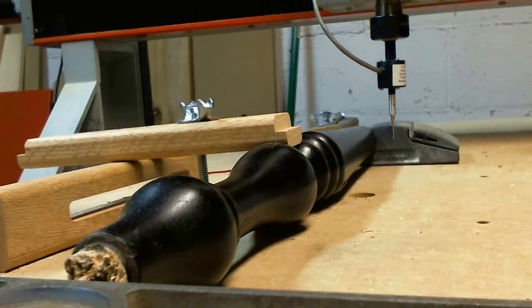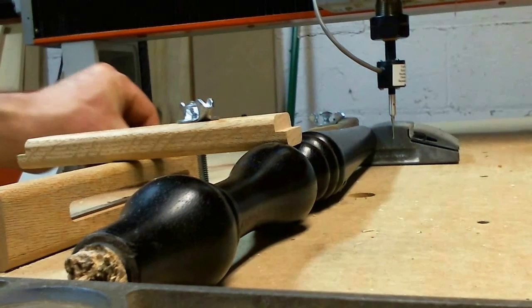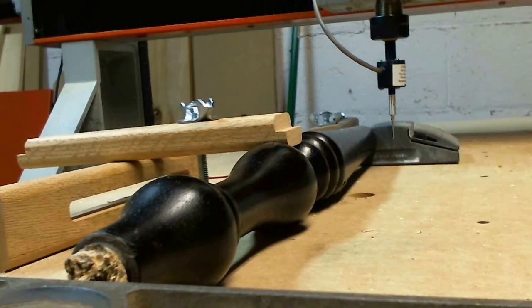So I'm going to go ahead and set this up here. I'm not going to scan real fine — I'm going to do 1/10th of an inch increments. I'm going to do negative on the X scan so that it starts in the negative direction, and positive on the Y to start. After it touches off, it will start in those directions. I'm going to scan at 30 inches per minute, saving it to a DXF file. And here goes.